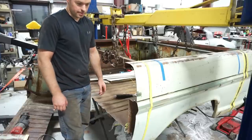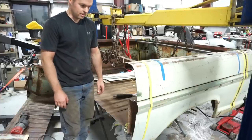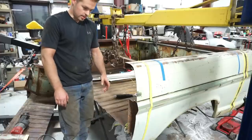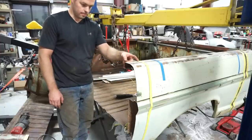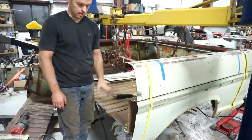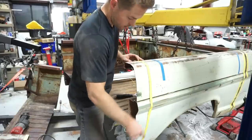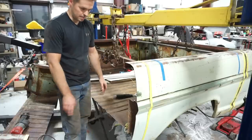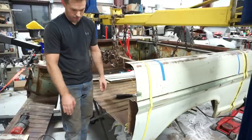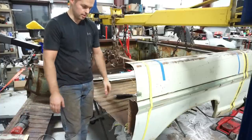Well, back's off. It cut pretty easily. Didn't run into too many snags there. So now I'm going to figure out how to check our measurement again and make sure we're right at 4 inches here. And double check. And then again, take the saw and lop the additional 4 inches off. And start doing the fitting and finishing with the flap disc to put this rear cap back on this section here.